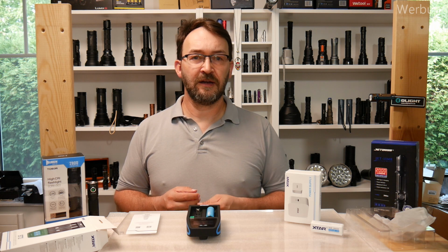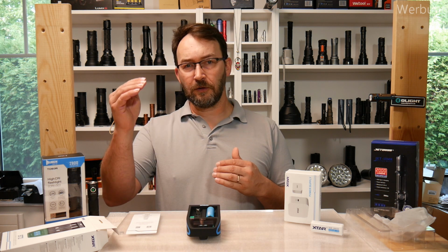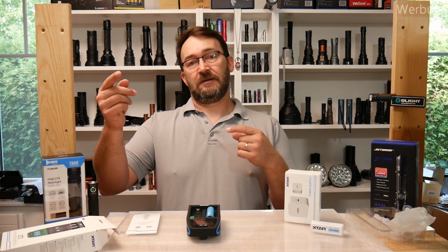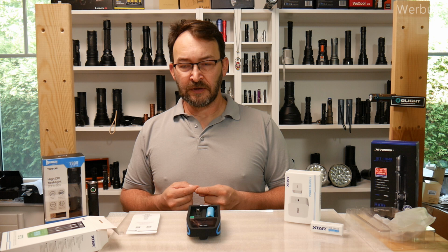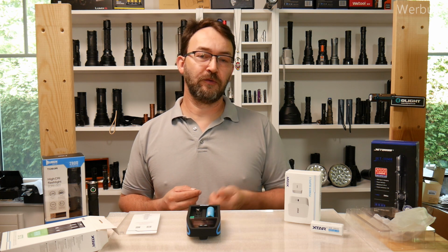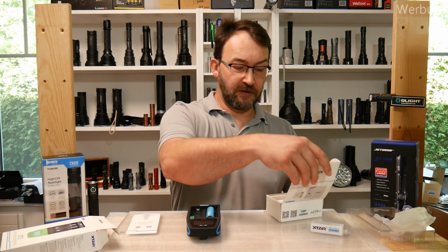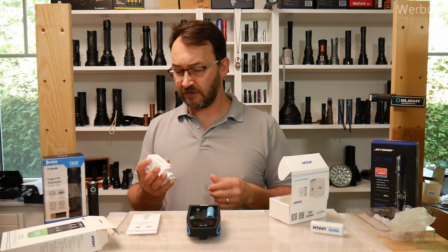If you use one of the newer power supplies that are going by the Quick Charge QC 3.0 specification or protocol, they can raise the voltage, so they have 9 volts or 10 volts and 2 amps, which allows the system, by dividing the voltage down, to dial the amperage up. So on a Quick Charge 3.0 you can use 4 amps in total, which is 4 amps on one channel or 2 amps on both channels. And to have the full power, you need a power plug like this, which is compatible to the protocol named PD 2.0. Don't ask me what it is for.